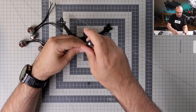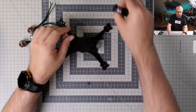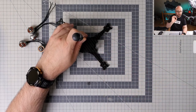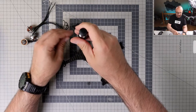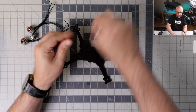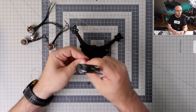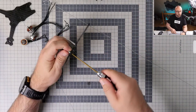The solder used to solder everything originally was kind of, I'm not sure how to say it in English. Let's say that during heating up, the solder was exploding some almost invisible solder blobs. And some of those blobs just hit the 5-volt rail, destroyed the LDO, destroyed the MCU. So the flight controller is actually no go to anything, most probably beyond repair. I mean, it's possible to replace the LDO, it's possible to replace the MCU, but then I'm not sure if this really makes sense to do it, because then it would be bloody expensive to do it.